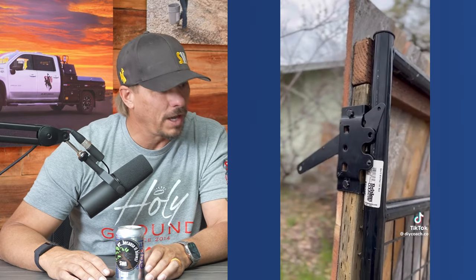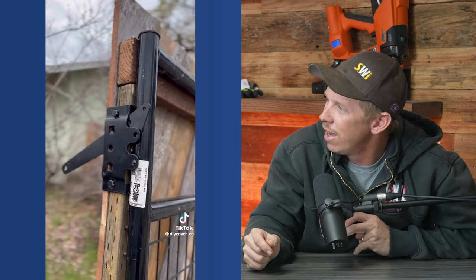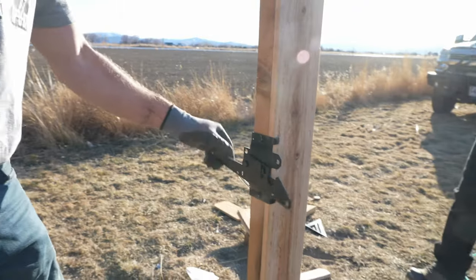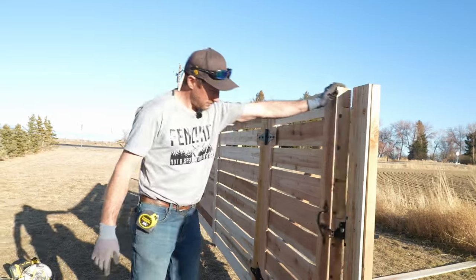They have the receiver on the gate, not the peg. The receiver half is on the gate, not on the latch post — we put the strike on the gate instead. Maybe they don't want to attach that to the house, or maybe there wasn't a post there. I would have set another post right at the house specifically for latching. It was probably a corner issue — if they had the receiver part up against the house, it was going to be hard to access the handle.